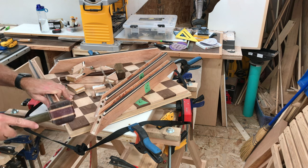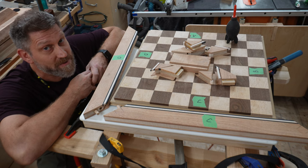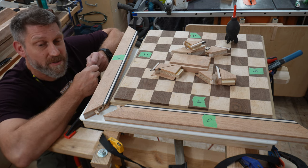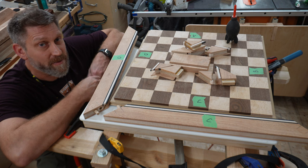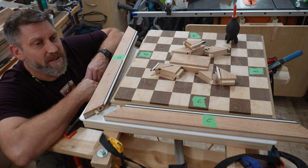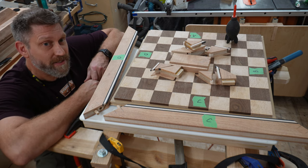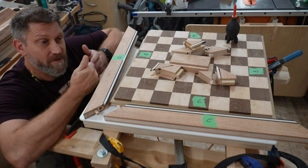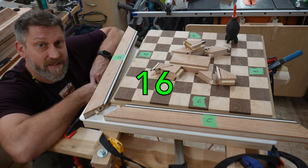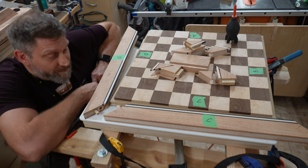That's pretty tight. I'd better sand these down first. Too bad this one's glued in already. Well, I was right to be cautious and concerned about these dowels. Even though I had a guide and I was lining it up with a square and taking every precaution that I could, making sure everything was locked in and marked and level and straight and lined up, there's still just a little bit of play in that doweling jig, and it's easy enough to get off on your angles a little bit. And multiply that times 8. It didn't go perfectly. Let me show you.